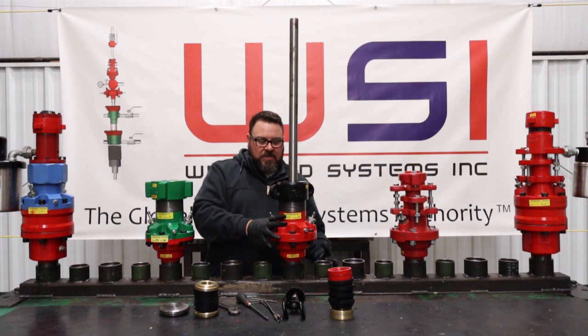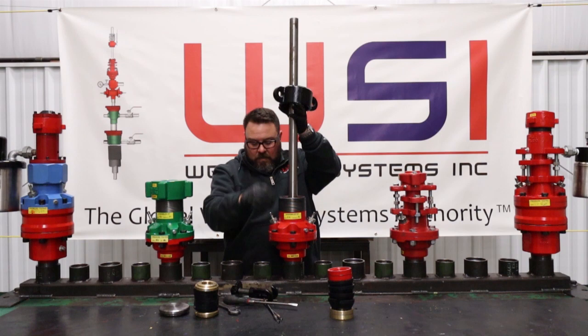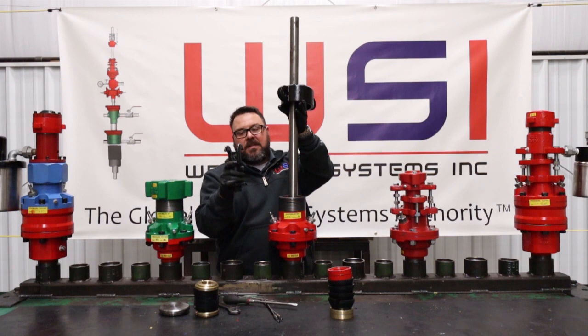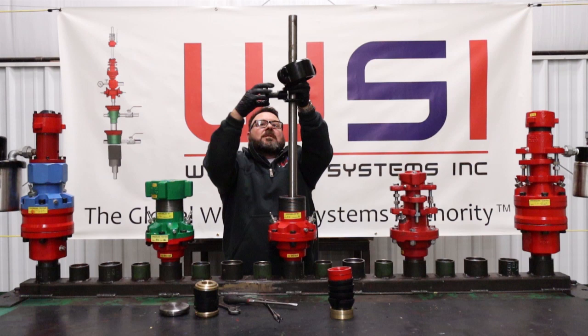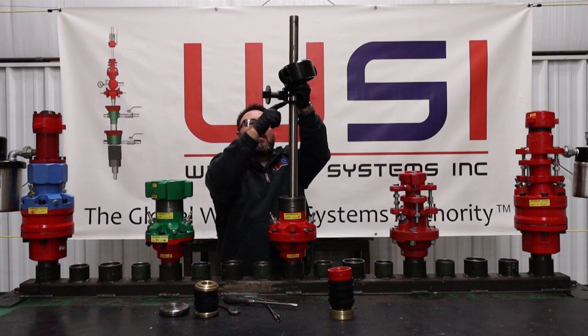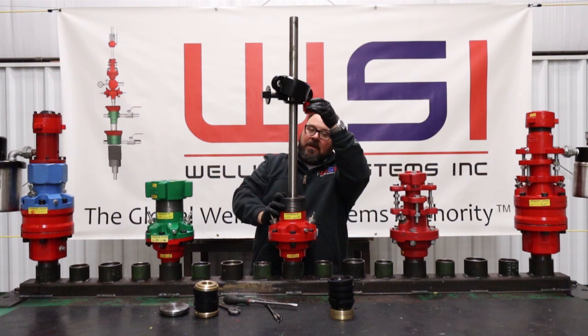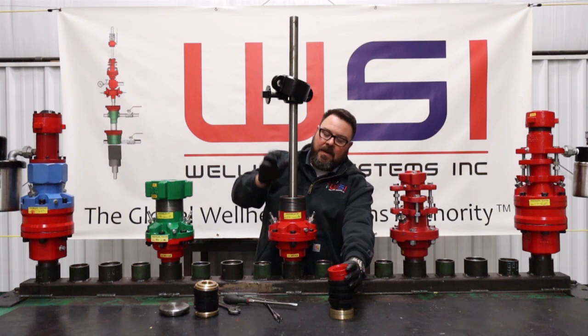We're good — BOPs tightened in, well shut in. Grab your third hand and loosen the BS top cap. Raise that up on the well. These work easiest if you have them all the way open when you start. Up here on the polish rod, turn it and then operate the screw — hand tight is all you need. Don't get a wrench on here; even though it looks like a good spot for a wrench, you get one on here and you're going to scar up your polish rod and prematurely wear it. You would normally also have the upper follower here, but for the sake of this video we've already removed it.